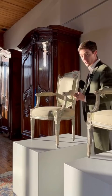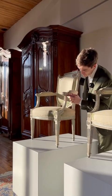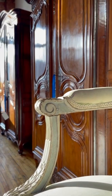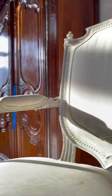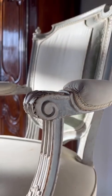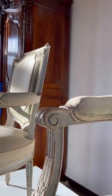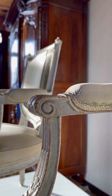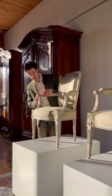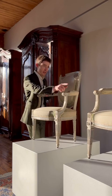One of the more obvious things to check for on French period chairs is period-correct joinery, such as the presence of these dowels here that are peeking through the paint. While we're looking at the dowels, we often check to make sure that the scrolls of the armrests on these period pieces are slightly irregular as well, as they should have been sculpted out by hand with a master furniture maker's chisel. We can see reassuringly, at a glance, that each one of the scrolls on the armrests is, in fact, slightly different.